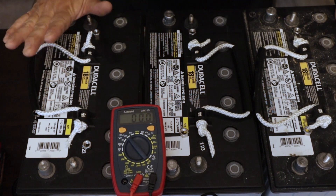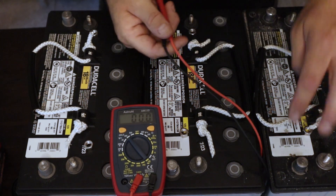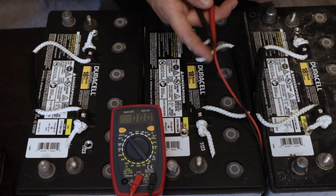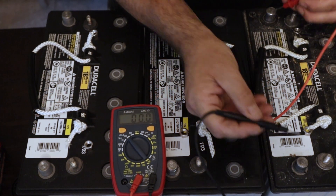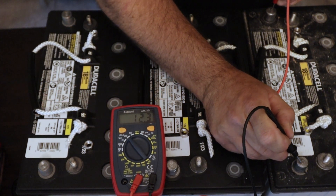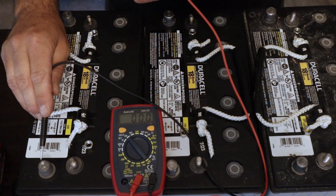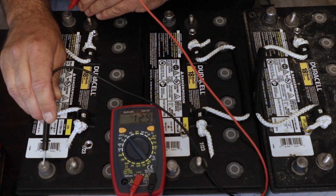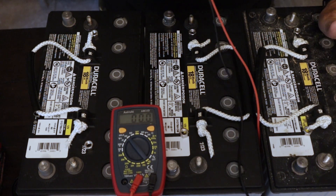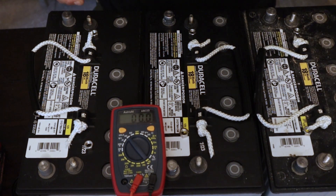You can see here these are not connected in any way. I got the nuts for these studs off to the side, negative sides over here, positive back here. So I'm going to take this voltmeter and go ahead and take a reading on each battery. The first one: 12.3 volts, 12.9, and 12.9. So you can tell this one's a little used — it's not quite getting up to voltage and it might not be fully charged. That's what we got for each individual battery.